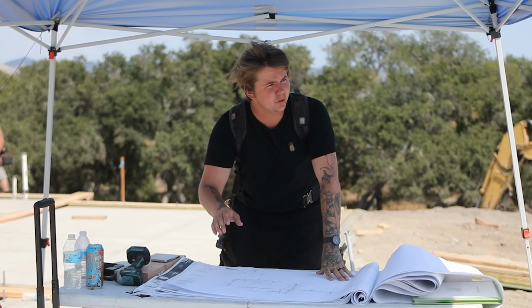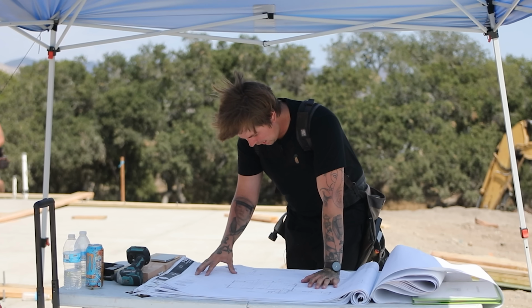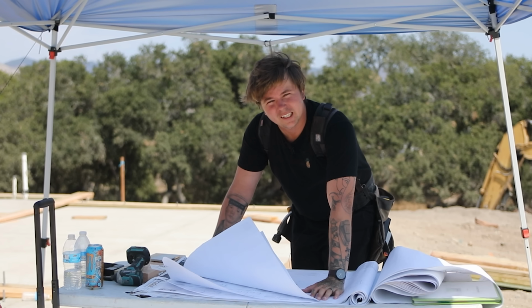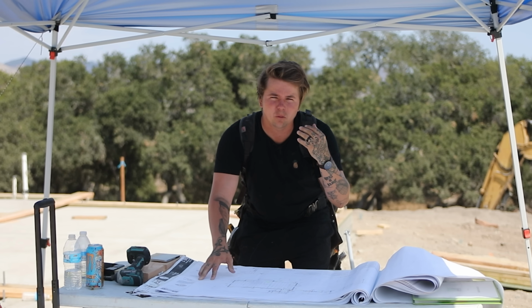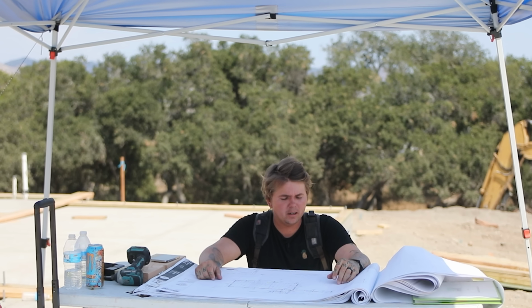So prior to actually building any walls, I like to go through and make sure that everything is right. The more I can plan ahead now, the better off the project will go once we start framing. It's actually getting windy out, which is kind of nice. I have one area where I have no top plates. I just have the header running across and the two plates run into it on both sides. There'll be a strap connection there.